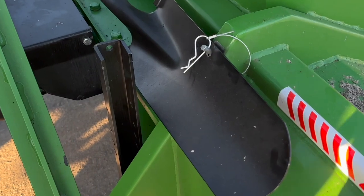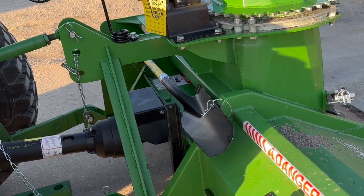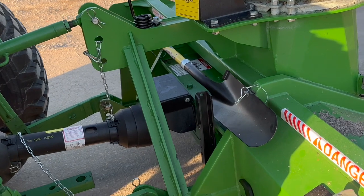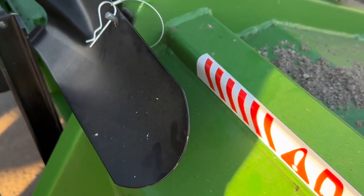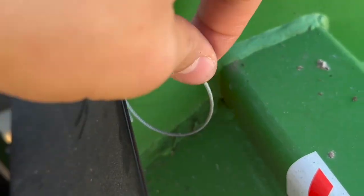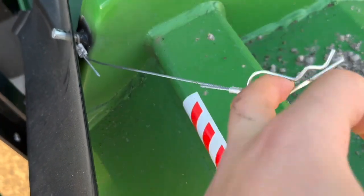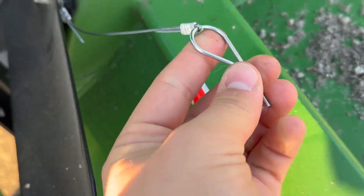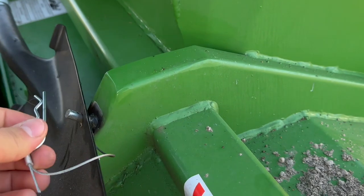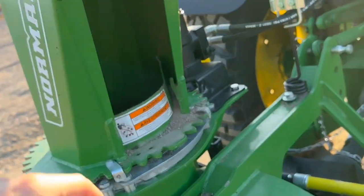You also got your shovel in the back here. We custom fabricated these and this is absolutely mandatory. Don't think you're using one of those pocket shovels you could hide in the cab to unclog your blower — it's not going to happen. We got these nice heavy-duty tree spade shovels. We welded a clip with holes in it and hardwired these clips in, wrapped around a piece of steel with holes. You unclip it — see that wire — so we don't ever lose the clips. You know how operators can be; it's quite easy to lose stuff when you're freezing outside. You take your shovel off, come around to the chute back here, and just start hammering your shovel in there to unclog it.